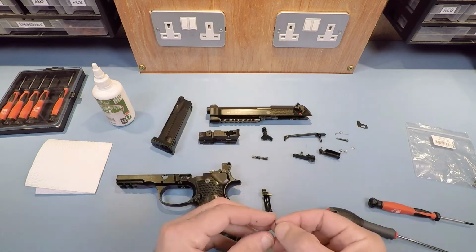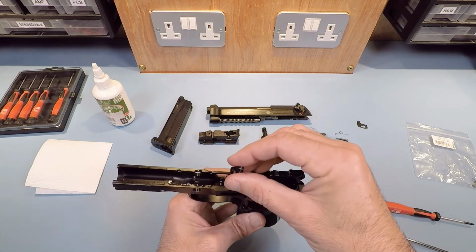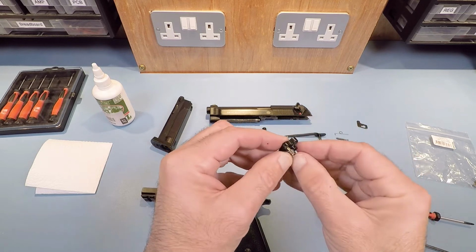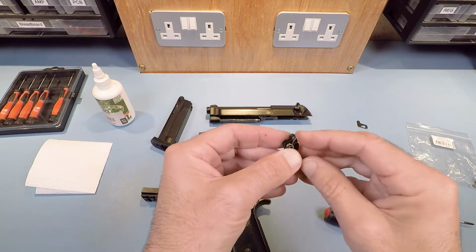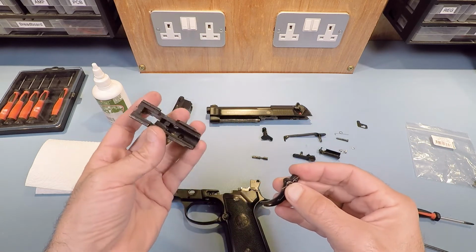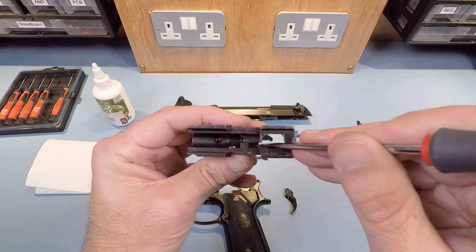Okay, so essentially when this was inserted, I did have a problem with trying to work out the orientation because I didn't take note of that and took it out. Now if I remember rightly, when this was in here, the trigger was positioned like this, and when I saw the spring it looked like it was physically set up like this. So it had the bar here. So I turn it around the other way. It looked to be something, if I can bend that over. So again, you can see on the trigger housing here, let me just put that down a second. There's a slight notch in here, and that's where the other side of the spring was impacting on.